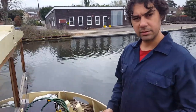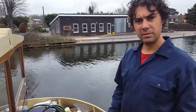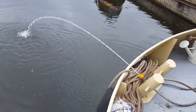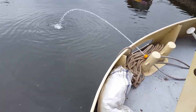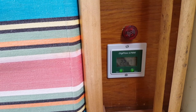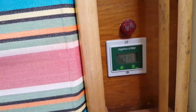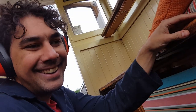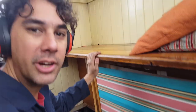We'll just run it through this setup, get the flow rate right, and let it run for maybe five minutes. The water's coming out through the hose, so that's a good sign. It's running at about 21 to 22 litres a minute, so I'm just going to tell Cory to lower it down. It's dancing around like 16.85 to 17.15 litres a minute. It's rated for 52 litres. We've got 5.5 litres a minute.